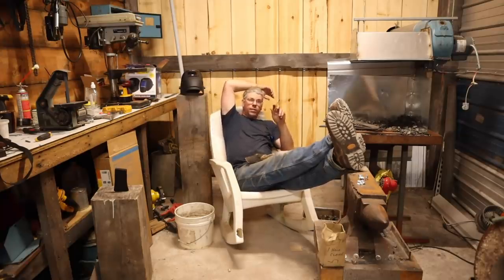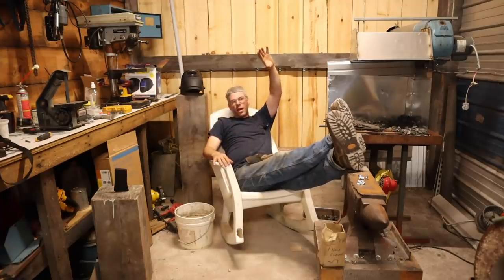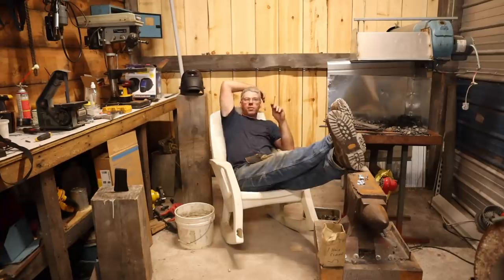And then on the outside wall, I've got a bunch of scrap sheet metal. It's not going to look the nicest, but it will function until we can afford to buy some full-length sheets to go from the floor up to the top of the third girt. So it'll still leave wood exposed in the top 3 or 4 feet of the wall, but from floor to bottom of the tie beams is 10 feet in here, and it's actually just about 12 feet up to the bottom of the second floor floorboards. Now that's plenty of height in here. I'm not worried about sparks going all the way up here and catching the building.